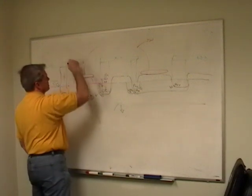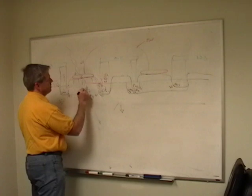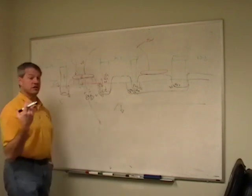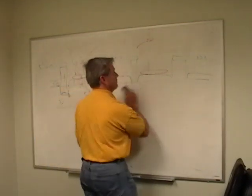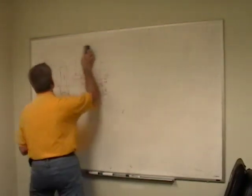One of the problems is when these cosmic rays and things happen, you get some of these electron hole things happen, EHPs happen right here at boundary layers. And what happens is your field oxide can generate a charge in it. Can develop a charge. So I think I've talked about all of this that I want to talk about right now. I think we've got the general gist.